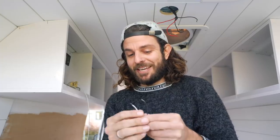Almost just came a real cropper because I was going to wire up the first of these LEDs and I thought, surely the black is negative and the white is positive. Lucky I didn't wire them all up and potentially solder them and then turn it on - because I tested it on the battery first. No siree - the black is the positive and the white is the negative. Seriously, what the f**k!